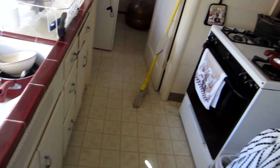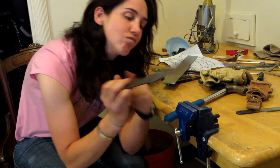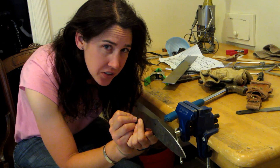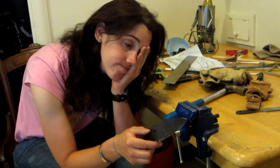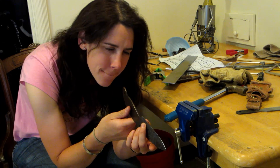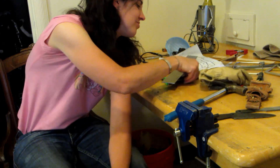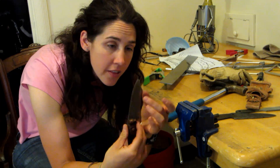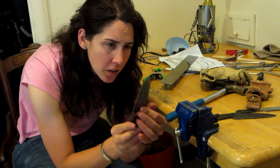Maybe okay — this is straight, okay. Now we're gonna check it. I think it's a bust. It's not straight. It's got a hammer mark in it, and I think because it was real thick here and I went real thin with the bevel, it just hardened and tempered unevenly — it's not right. This one has a lot thinner bevel in it; it's almost the same thickness all the way through, and it heated and cooled evenly.